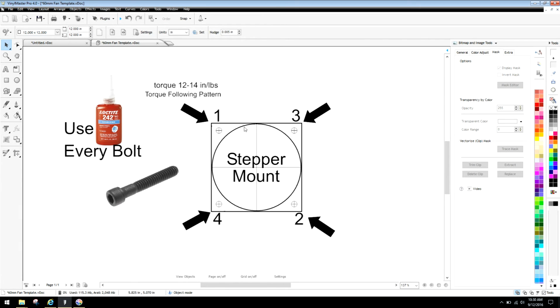You will not be torquing with the hand tool. You're just looking to bottom it out on the back of whatever mount we're going with. That's what we're looking at doing. So again, use common sense. If you have to use a hand tool just to get it to actually reach the bottom of the mount, do that. Once again, as soon as it does reach it, you stop. Okay, that's the easiest way to go through, and final torquing will be done when all screws, whether it be 1, 2, 3, or 4, are bottomed out on whatever we're mounting, and then you'll go through and torque everything.